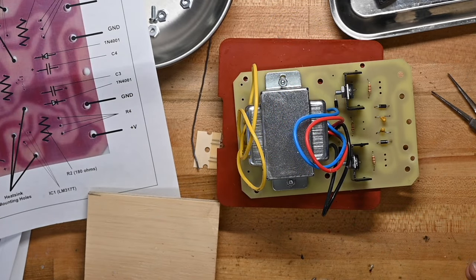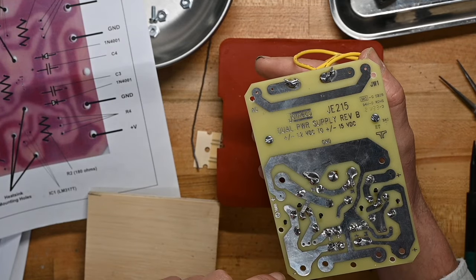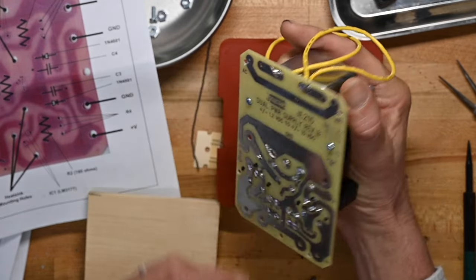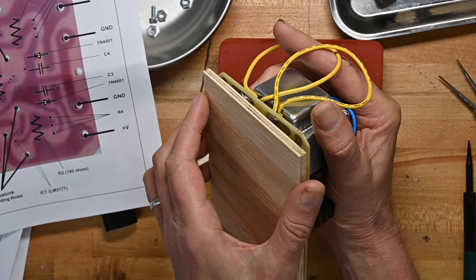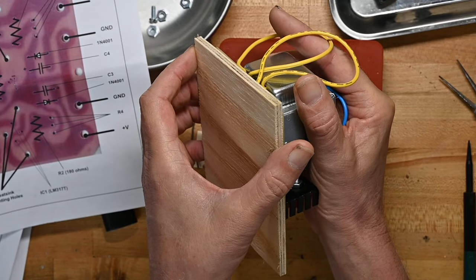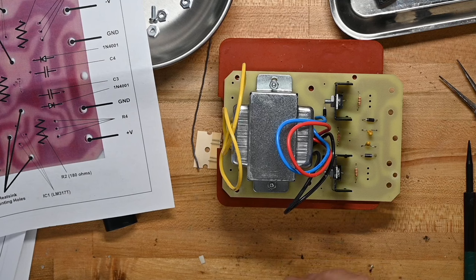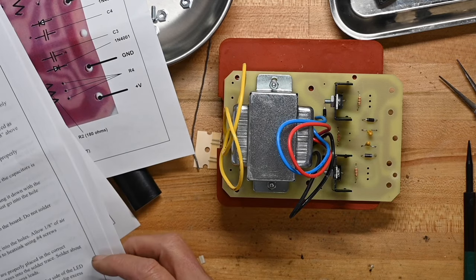While I was off camera, I did something else — I drilled four holes in the circuit board in places where there are no traces. Because as I was thinking about this, this is mains current coming into this thing and we don't want to contact any of that. So I'm going to put a piece of wood on the bottom — not just rely on the rubber feet. I was going to put a piece of Lexan, but this is so old a design that I figured wood is appropriate. I could have made it out of stone.